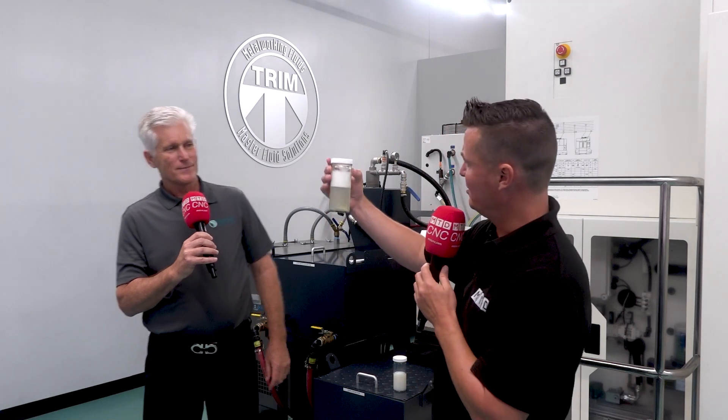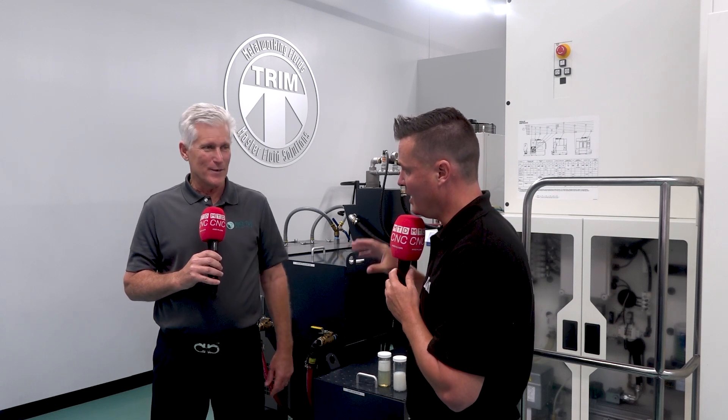The old coolant is actually getting worse as all the air slowly works itself out of the fluid. That's going to stay that way for probably 7 to 10 minutes. And if you're constantly running your high pressure system, that foam just keeps building and building until it comes out of the machine. That product isn't bad — it's just not designed for that new application. I definitely don't want to turn my machine into a bubble bath.